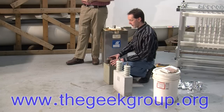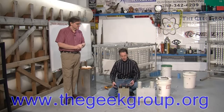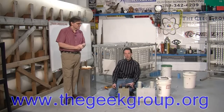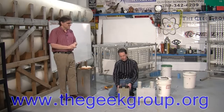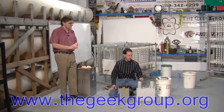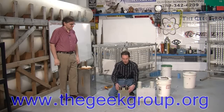Pulse caps, aside from the differences in internal construction, like you talked about earlier, have differences in external construction. On pulse caps, the length of the insulator is usually very, very short. The diameter is what they'll change to make up for the voltage. But sometimes you'll see the really long ones like this, and that's usually not a pulse cap. Pulse caps will have, for their size, really big bolts, which is why these things confuse people, because they've got pretty beefy bolts on them. That's a half-inch bolt on there. But you'll see this little tiny cap has these huge, probably 3/8-inch bolts. So for its size, they're really big.